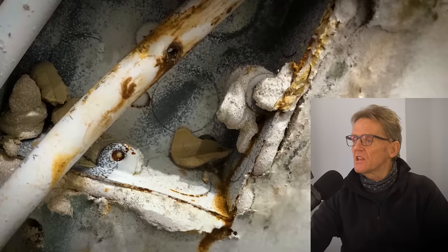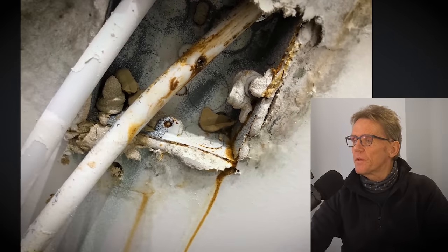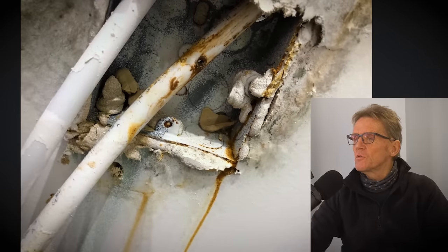As he said, the telltale sign was that little bit of drizzle. The plumber was able to make a repair — quite lucky, as it meant he could just put a fitting in and a connector and then carry on with the pipework. It just goes to show that if you're getting a pressure loss and you're baffled as to where it's coming from, it could be something as innocent as a screw or a nail going through a pipe and not really showing up.